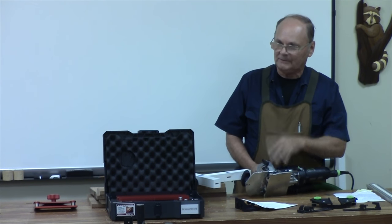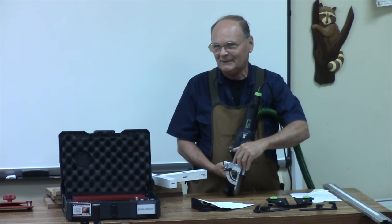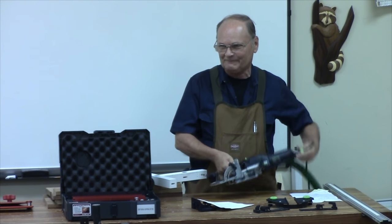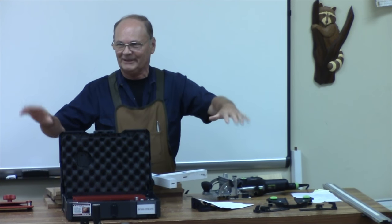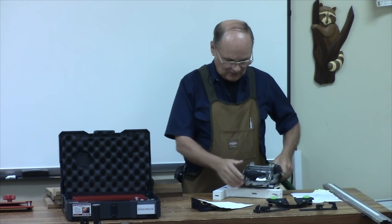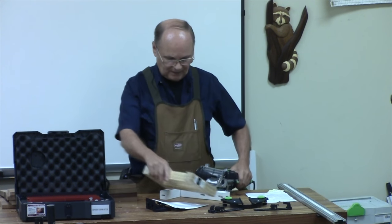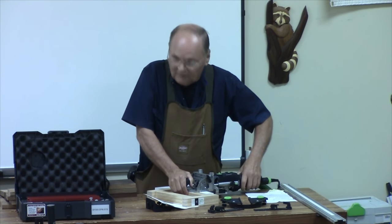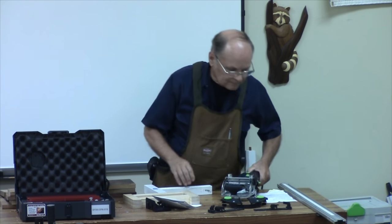This is a very precise instrument, but this height adjustment is not. When you're looking here to set it back on the line for 11, you might wind up at 11 and a quarter or something. What happened the first go-around is when I went to assemble it, it kind of didn't sit level because it was canted. And when you're holding the tool, you want to hold it firm on the workpiece — I found real quick that I needed to have another piece out here so I've got enough to hold it flat so you don't get an angle.